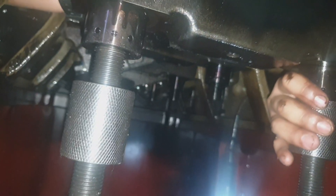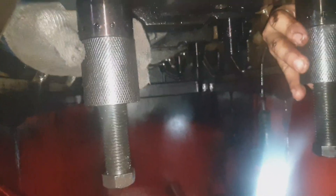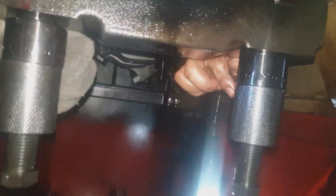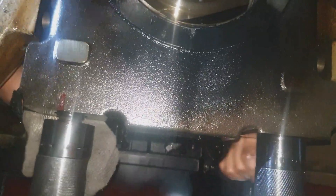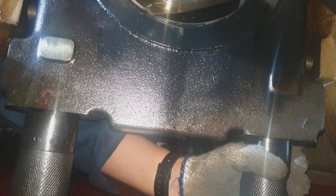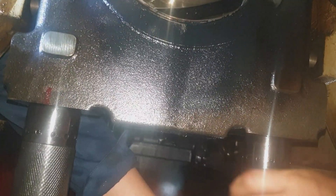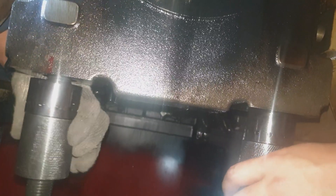We have to use a 10mm pin — or you can use an Allen key — to loosen the lock nut. As you can see, you have to be in rhythm so that it will not be difficult to drop the main bearing cap. We have to create some rhythm with the other lock nut. When you find it difficult to remove, just balance the removing procedure. The main bearing cap is coming down easy.